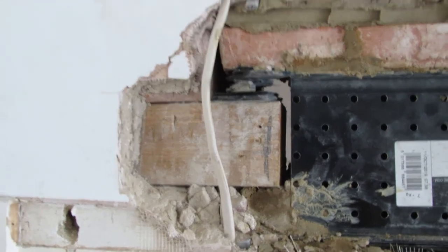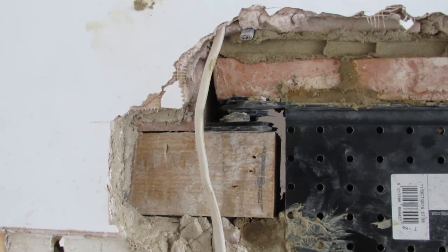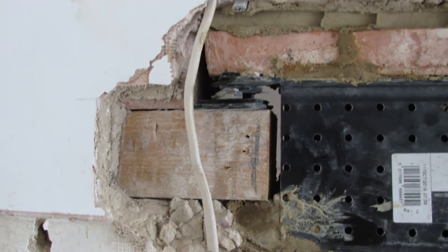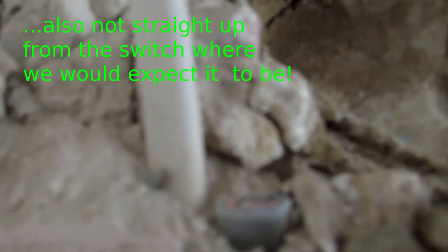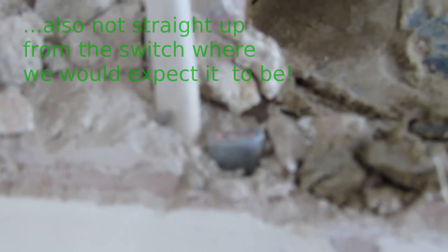You shove the cable — your twin and earth — down inside the trunking. So if anybody drills into the wall or hammers into the wall, you've got something to protect your cable. Now here you can see the way the last DIY guy did it: he just ran the cable in the plaster, which is fine until we came to chop the plaster out. And ka-dunk — one chopped bit of twin and earth.